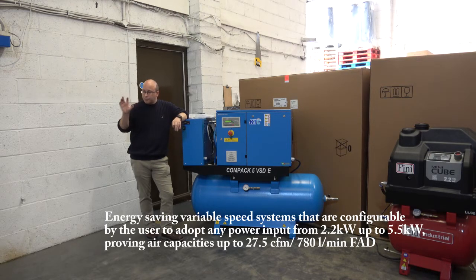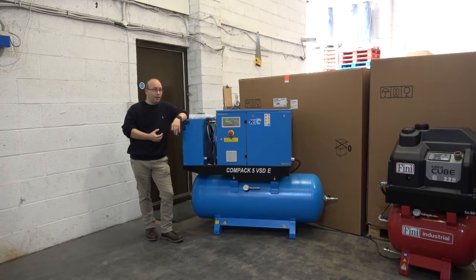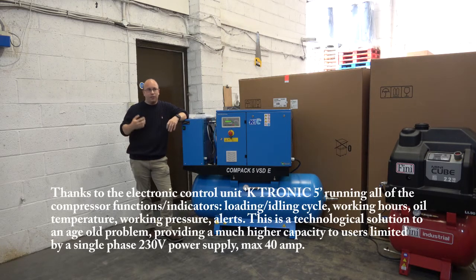The problem with that is in all instances, piston compressors are rated for a maximum duty of 50%. So even though you might be getting somewhere in the region of about 18 CFM through it, when you equate it to 50% duty, you're really going to get 9 CFM. And as a consequence of that, with a tandem machine, they get worked hard — always one pump will take the punishment. It's not an ideal scenario at all.